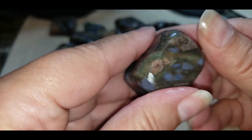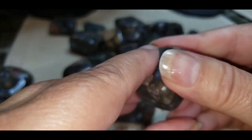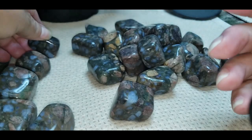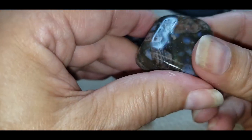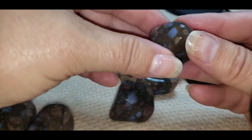But what I want to make sure is that I don't have any stones that have damage, any fractures that have happened, any undercutting, because it's conglomerate stone. There's a lot of different things in it. And we just want to make sure none of it's undercutting and it's feeling delightful. I'm thinking it's going to definitely be ready to move to 500 aluminum oxide, which means it's going to go into the vibratory unit, after a really good wash cycle.